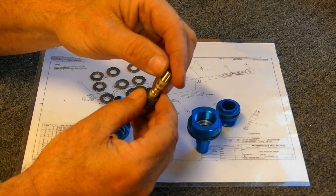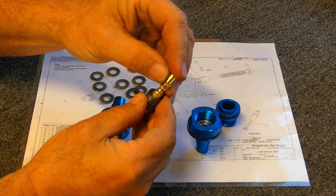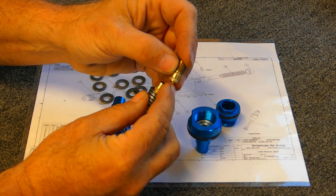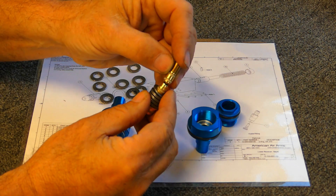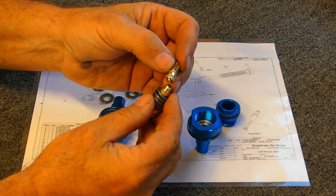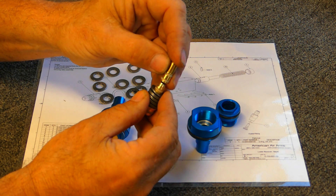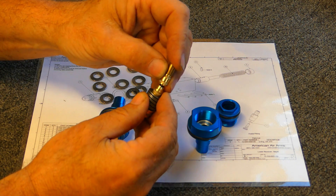What's actually happening is air is bypassing your seal, putting additional pressure on the piston as your regulator set point goes up. With a flat seal, you'll see that little round indentation. With a tapered seal, it can actually absorb quite a bit of pressure — you might end up with a slightly higher set point if you've had a leaky seal, but generally it won't destroy itself.